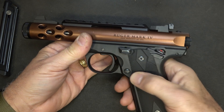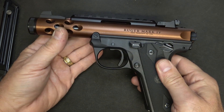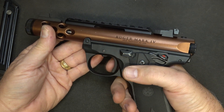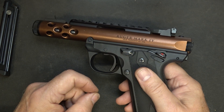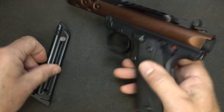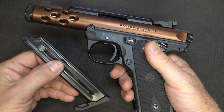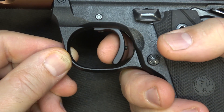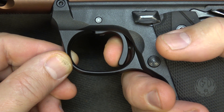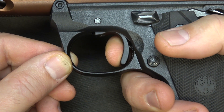Let's go ahead and check for function. We're going to put our safety on — it's working. Take the safety off. Wow, that is a really nice trigger. I don't really like to dry fire my .22 rimfires that often without a round in the chamber, but that's really nice. Now I can set my trigger screws however I want to control over-travel and take-up. Just a really nice system. And what I really love is I don't have to have the magazine in here to check — I hate magazine disconnect safeties, and honestly it was worth it just for that. But that trigger — fantastic. It's just a nice, crisp break. You feel like you come against the wall so you know when it's going to break, but it's not much pressure to push it over the edge.